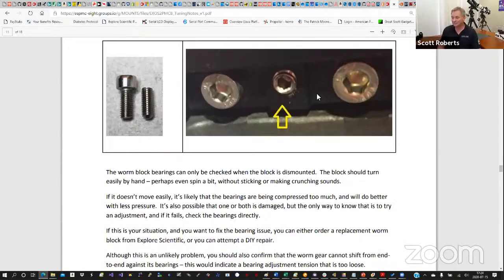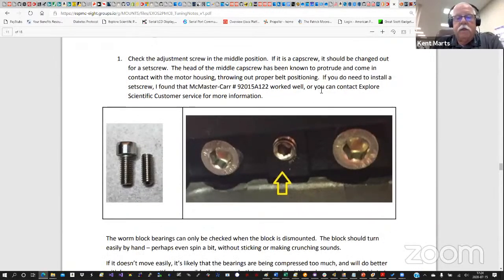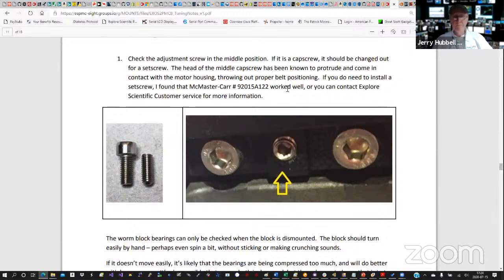Yeah. So Jeff Wise says it's called hypertuning. Actually, Jeff, we call this tuning your mount. Hypertuning involves, in our view, taking 6,000 grit jeweler's rouge and polishing bearing surfaces to a mirror-like quality, and polishing every gear tooth in the gear train, and really that's hypertuning. Take them out and go use it, and look for the big things you can do to improve.